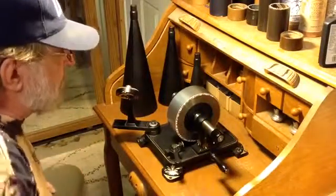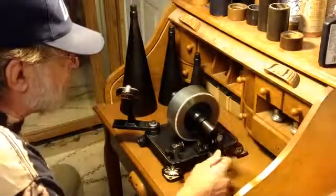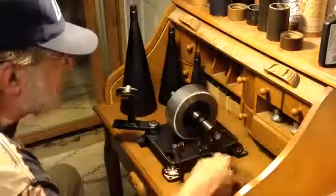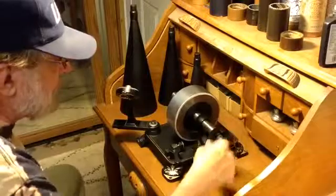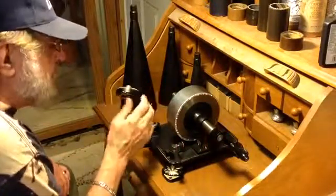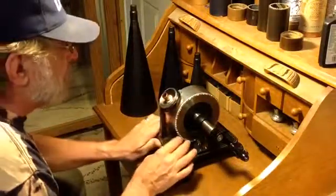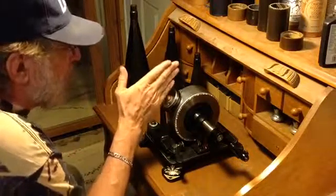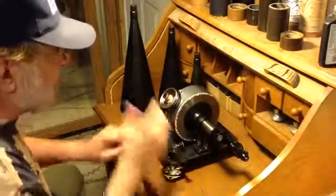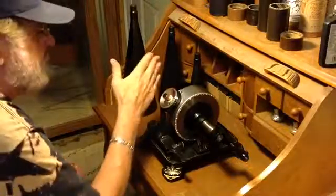So I just wanted to do a quick recording with a speaking tube. As I said, it's just an ongoing series of experiments. I've learned a lot. I'm really beginning to get to know the machine now. And looking at the groove, you can tell if the stylus is too deep, not deep enough, too far to the left, too far to the right. And the adjustment for the recording stylus, you can actually jump one complete groove either way, and it'll record both sides of a groove. You can jump over to this groove, you can jump over to that groove.